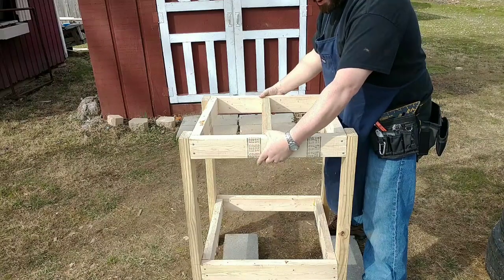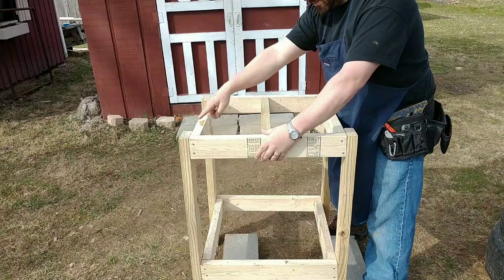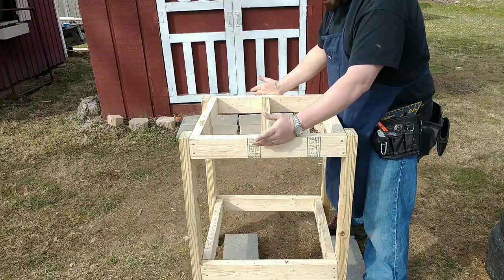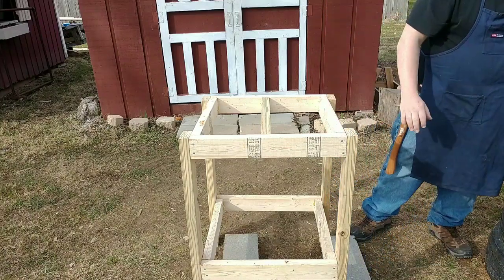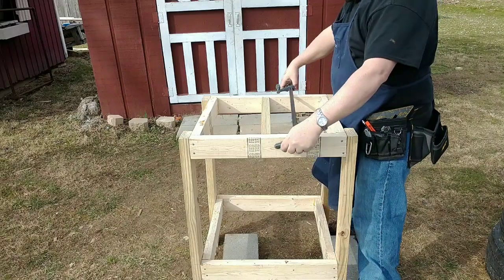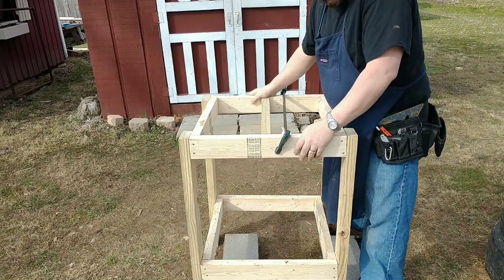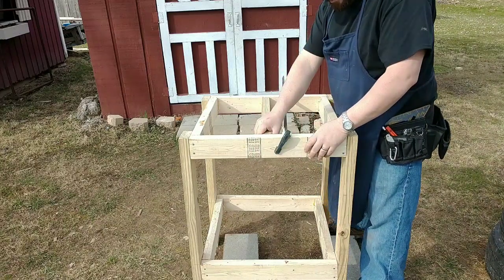So you can put all this together while making the square pieces here, or whatever size you want to make this. I'll leave that up to you. Sometimes it does help to have it standard, but you'll still want to use some wood glue, and you'll want to go ahead and use these bigger clamps to clamp on the side here and let the wood glue do its thing, and then nail it in there, or use your screws in here and do the same at the bottom.